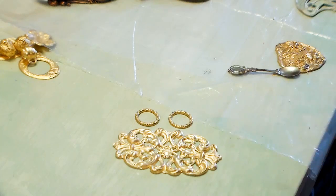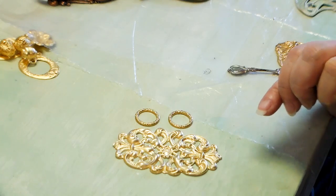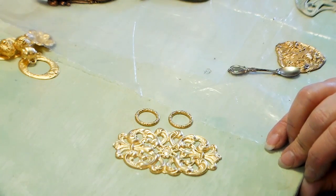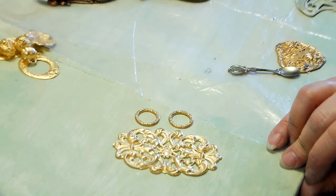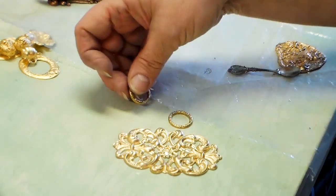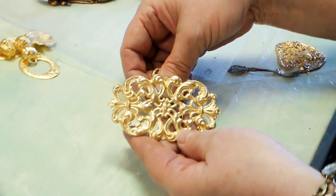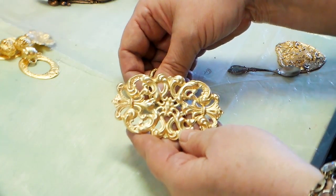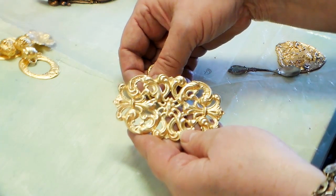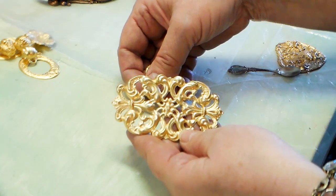This is raw, unadorned, unplated brass that's just been degreased. If you use it without sealing, in time it will oxidize and get tarnished — some people are fine with that, but it may react to some people's skin. It is very mellow and almost does look like 18-karat. We use rich low brass — that is the type of brass you want your jewelry stampings made from. At bsuboutiques.com we order only rich low brass; if it's not rich low, it goes back.